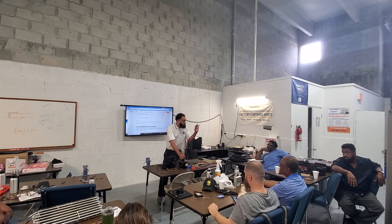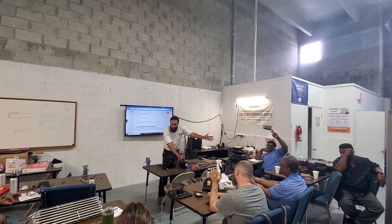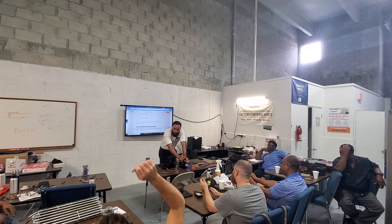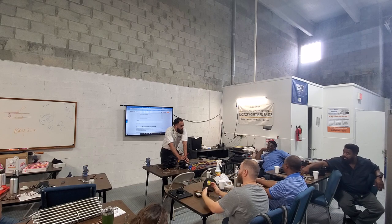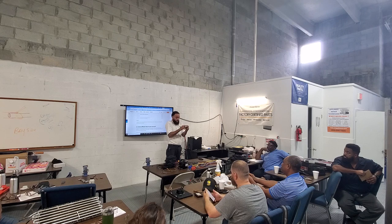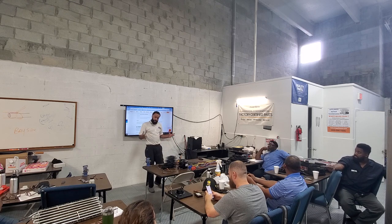Now, we go to one pin and the spot where we scratched the shell. Do we hear the beep? Yes or no? No. Who says yes? Okay, I got a yes. Who says no? There's no neutral here. Choose a side. No. Okay, write this down. You're not supposed to hear it. If you do, that means the winding has gone bad, and now it's touching the actual frame and it's giving you continuity. That's a bad compressor.